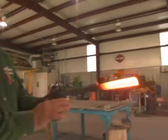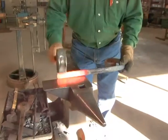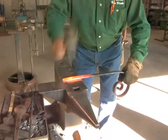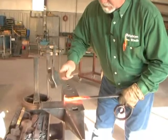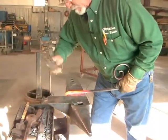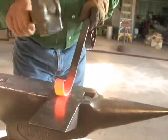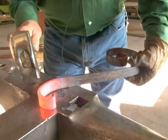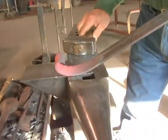Now for the S scroll — I started this earlier, but we've got to taper it so we can start the scroll. Taper it, always bringing the material back into dimension. We'll turn the edge over the anvil, roll it back, and that's our hook. Now we're going to start the scroll. It's very important to get it fluid, because if it's not right and you're past this stage, you cannot go back. Everything has got to be the way it should be before you move on.